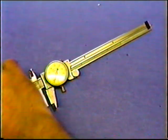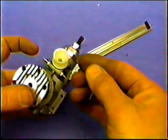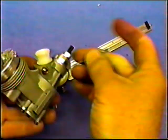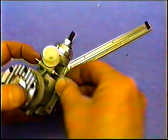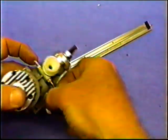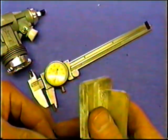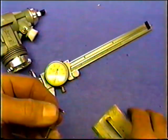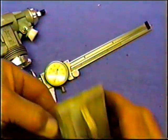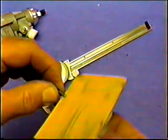Anyway, as I'm talking and trying to videotape, one of the things I do, and it's just cheap insurance, is always put a piece of tubing on here, plug this off, and make sure you can blow through so that the fuel is flowing nice and freely. The normal setting, now this is another little detail thing, and these are not things that keep the motor from being bad in any way, but I know this edge here, I like to dress it off just a little more than they do at the factory. These are just personal preference things.